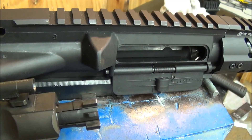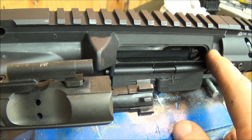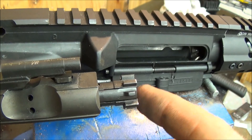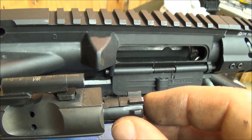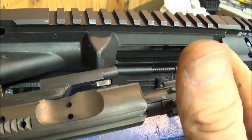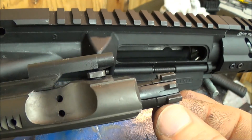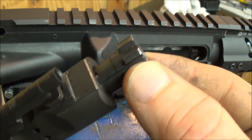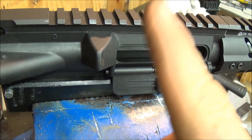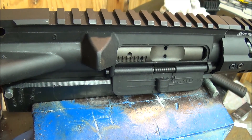For those who caught this — the reason I did not headspace this barrel to this bolt is because these are a match set, same as with another rifle, the other SPR I'm in the process of building that I'll show you later. The bolt and barrel are already headspaced and matched to each other. No other bolt, no other barrel — it's the tightest lockup you can possibly get with that particular setup. They will potentially work in other rifles, but they work best in this one.